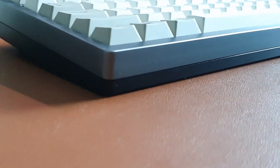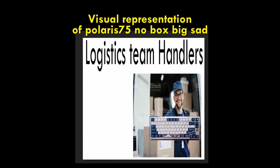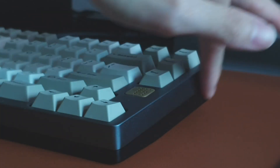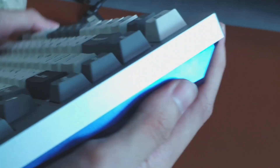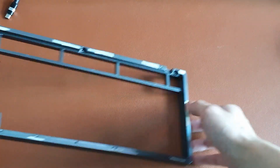So what are the drawbacks? The answer is: many. First, the overall quality of the board — you truly get what you pay for. Both of my units were shipped without a box, just the case, plate, and PCB rolled up in bubble wrap. My current unit has a big ding on the top left corner that won't buff out, and the brass weight had one stripped screw thread. I had to stick tape to keep the screw in. The anodization was rough to the touch with typical flaws — banding and, according to Qichen, anodization mismatch, which is why they recommend picking different top and bottom colours. The top and bottom case also slightly misaligns and there are no alignment pins.